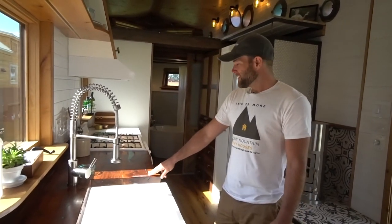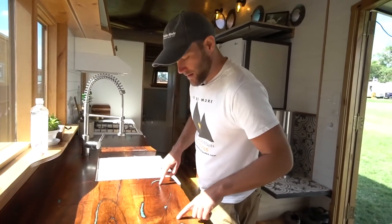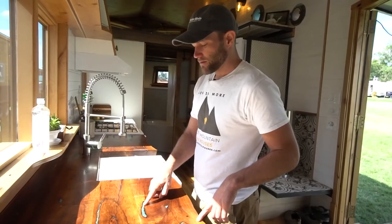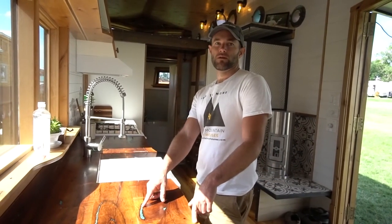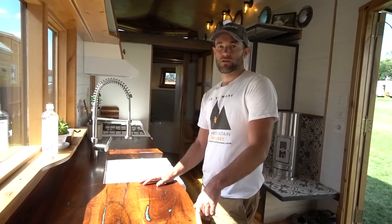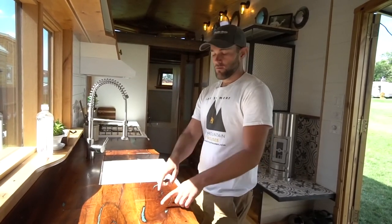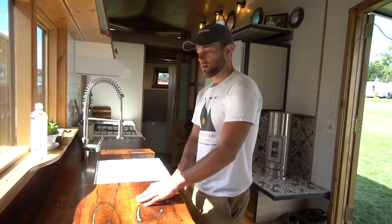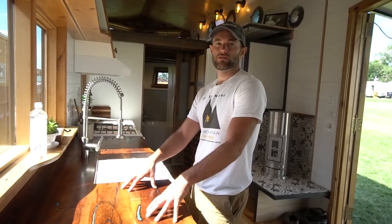It's beautiful. Everyone wants to know how the turquoise inlay was done — it's super simple. The wood has natural cracks in it, and I purchased some raw turquoise from a gem store in Durango. It's called Sleeping Beauty — a really sought-after turquoise in the Southwest. You just crush it, put all the pieces in the crack, epoxy over it, and sand it flush. Then we've got a really nice Murdoch's finish over it — one of the best finishes we could find.